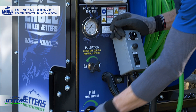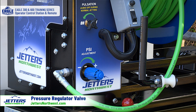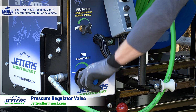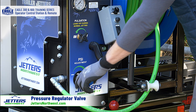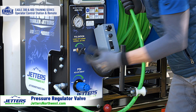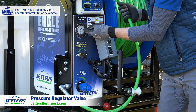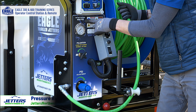Down here we have a pressure regulating valve. Generally when running off the main hose I use throttle up and down to raise and lower pressure, but this valve also sets the maximum. So if you're jetting an old Orangeburg pipe and don't want to go over 2500 PSI, you can set this to a maximum of 2500 — no matter what you throttle to, it won't go there. This is also important when using mini hoses: back this off about three full turns when using a quarter-inch hose or a trap jetting hose, so extra pressure in that small hose doesn't push you over 4000 PSI. Do not exceed maximum pressure ever.